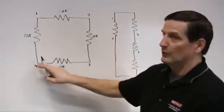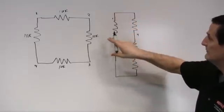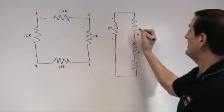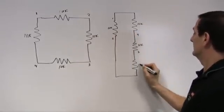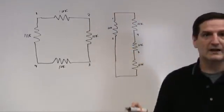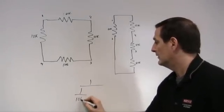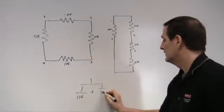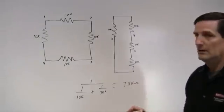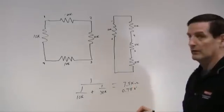Pins 1, 2, 3, and 4 are the access pins to the device we're going to measure. We're going to source between pins 1 and 2, so we have one resistor in parallel with three resistors, all 10k ohms. The actual resistance works out to 1 over (1/10,000 + 1/30k), which equals 7.5k ohms. We're going to source 100 microamps through this, and it should drop 750 millivolts or 0.75 volts.